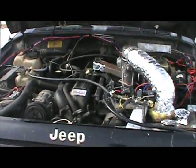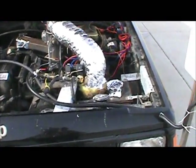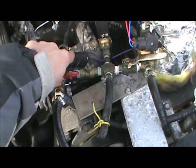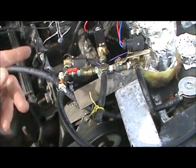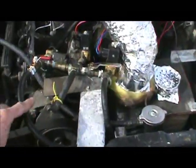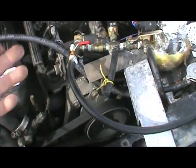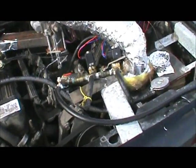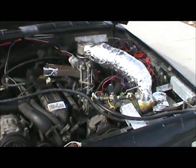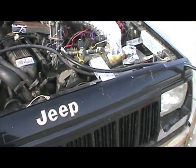If you guys enjoyed it, once I get that float switch in, then I can really do some testing. I was afraid that with this solenoid valve right here, because it needs like 1 psi of pressure to let the liquid flow through, I wasn't sure if it would or not. But when I have this container connected up to it and I open up this valve right here, it does let it flow through just fine. So that's a wonderful thing. But once I get that new float switch, I will connect it. Right here is where the float switch goes. Man, stinking little things here and there, it's just extremely irritating, but life goes on.